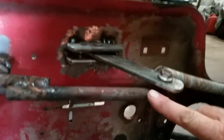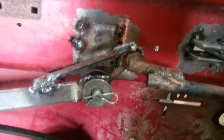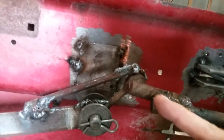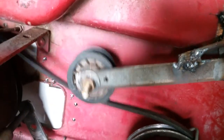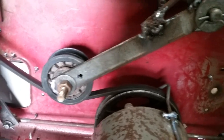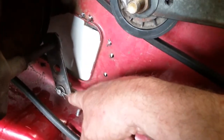The gas pedal is just a spring rod on a pivot with a push rod and tie rod connections, welded so that when it pushes one way it engages the belt. The more you push the gas pedal, the tighter it makes the belt and the more engaged the transmission becomes. The shifting is basically just a rod coming through the side with a tie rod end connected to the shifting mechanism for reverse, neutral, second, third, fourth, and fifth.